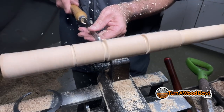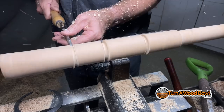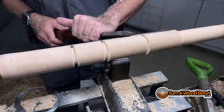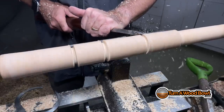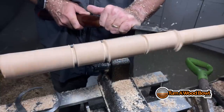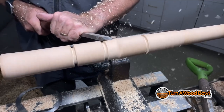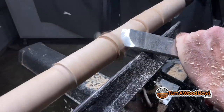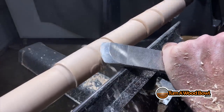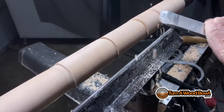If you haven't done a lot of spindle work and you're cautious about it, the cup drive — I'll put a link in the description below — is a great way to start. If you get a catch or a kickback, the wood just spins inside the cup rather than coming flying off, because you don't have deep spurs engaging it that would force the wood out of the lathe. Instead it just spins on the location it's mounted on.